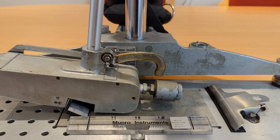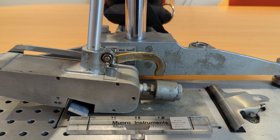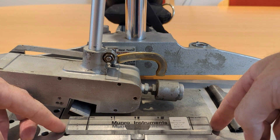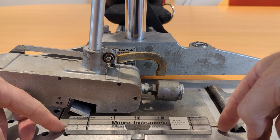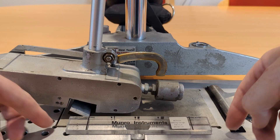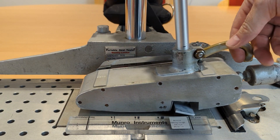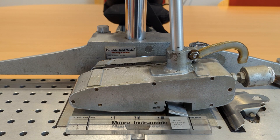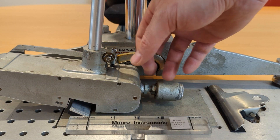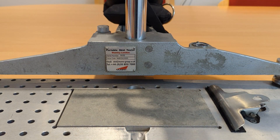You can see here it's much closer to where you want to be, but again it's the same process — just halve the distance between where you are now and that black line. Having made the adjustment, repeat the process of moving the setting gauge with the left hand line to the back of the aluminium slider plate, then move the foot over to the other side to check whether any further adjustment is necessary. If there is, keep repeating that process of halving the distance between where you are and where you want to be.